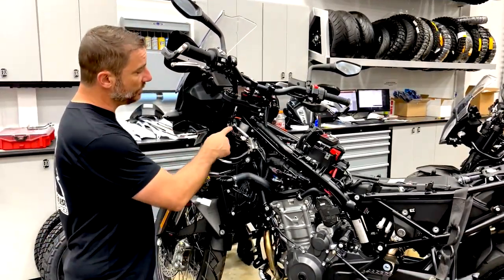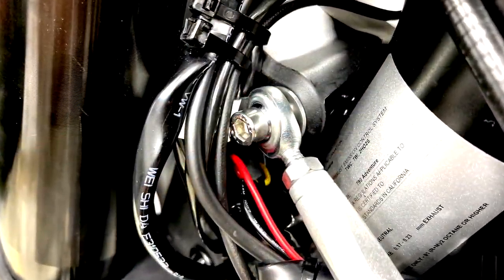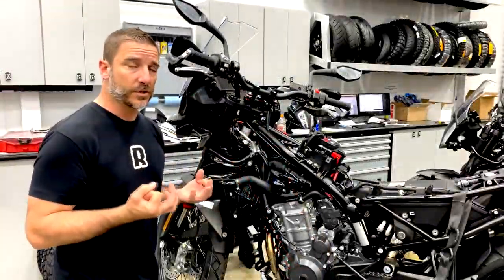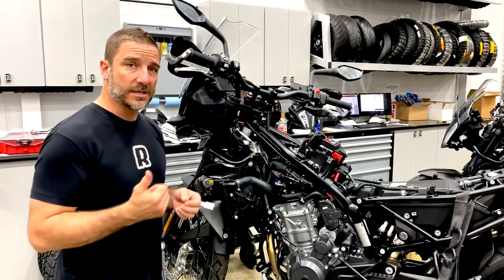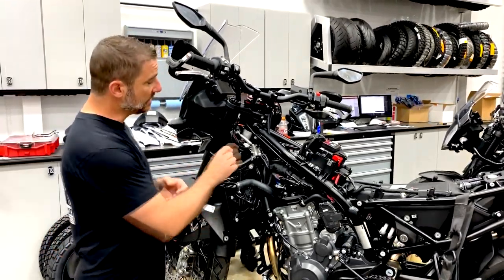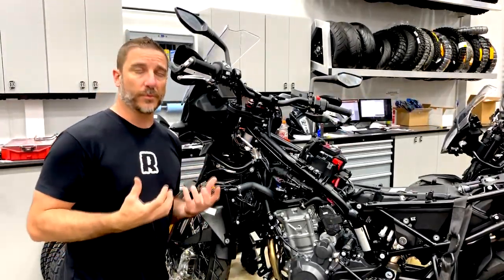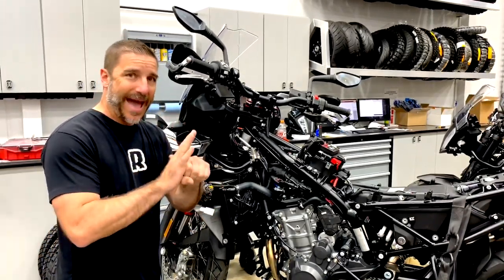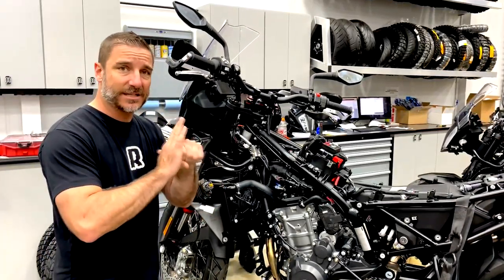The second feature is we're using precision rod ends. A precision rod end has a precision hole going through a six millimeter bolt, and there are two advantages with that. The first advantage is it's not a slot — we've seen some mounts out there with a slot, and the problem with that is you're relying solely on the pressure of the back side of a very small head against the material.